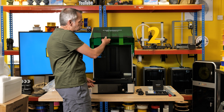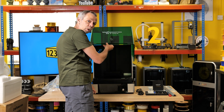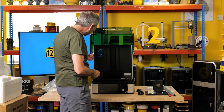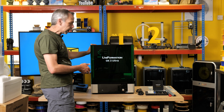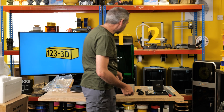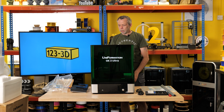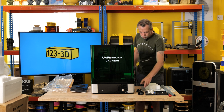I'm seeing a really, really nice brush seal. I did wonder why this lid felt quite frictiony as I was lifting it up — there's a little bit of resistance. This is due to the fact that they are fitted brush seals, so when this is closed there's a nice air seal around the door to the frame, stopping any nasty fumes from leaking from inside the printing closure. The actual charcoal filter literally just pops into the back and holds in place with magnets.